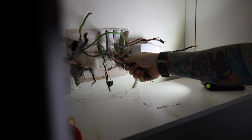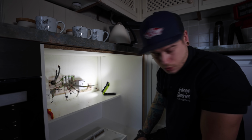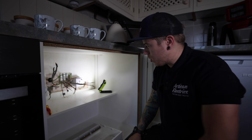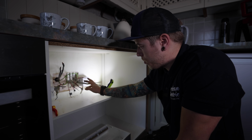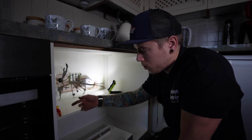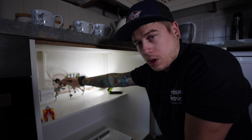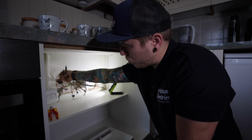Just a little update. So I've got the old wooden relic off the wall. A lot of the earths weren't even sleeved or anything. I've labelled up all my cables according to my bit of paper, what order I'm putting them in. So the tails I'm going to pull out, and we'll pull new 25 mils through from the meter box the other side of the wall.